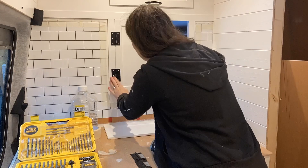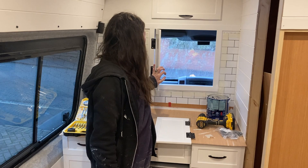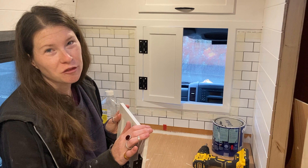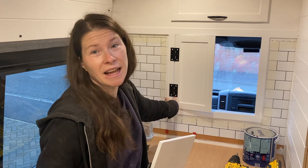Once all the coats of paint were dried, it was finally time to hang the doors — or so we thought. These doors fit perfectly before I painted them, but as you can see they're not shutting, and this one doesn't even fit in the hole anymore. Basically because they've had four coats of paint — two coats of undercoat and two coats of topcoat — it's just made them thicker on the top and the bottom. They must have been pretty tight beforehand. I just didn't account for the paint being so thick, and now I'm going to have to sand them again. I'm sure they'll look fine eventually.